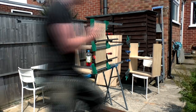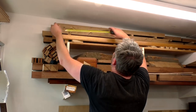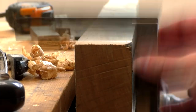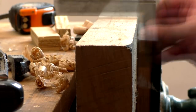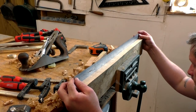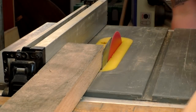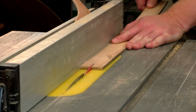Fortunately it was a hot day so the glue was grabbing pretty quickly. I also needed to trim the plywood edges of the right hand side panel of the desk, so I found another piece of oak — this is the stuff I salvaged from a local church refurbishment a few months ago. The wood had moved a bit since I brought it into the workshop with seasonal changes, so I first needed to get a square and straight face on it. I used my hand plane to get it nice and straight again and make sure the edges were at a perfect 90 degrees. I could then offer up the flat face to the rip fence on my table saw and rip some more 5mm thick pieces. As this piece of oak was quite thick I made this cut in several passes raising the blade each time, as this wood is very hard and very dense. I used the hand plane again to straighten up the edges of the trim pieces and then ripped them to 18mm in width.